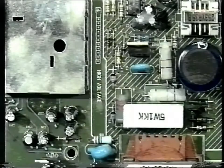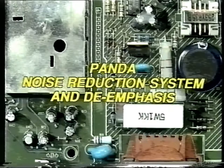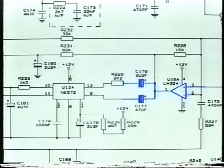The PANDA system is used by Astra for its narrowband FM subcarriers to give superior dynamic range and signal-to-noise performance. The signal is compressed according to its level and frequency. Therefore, for an FM system, a smaller bandwidth is required. This introduces less noise, therefore more subcarriers can fit into a given channel. At the receiver, the signal is correspondingly expanded to reproduce the original signal.